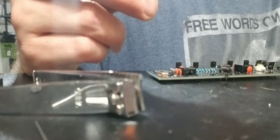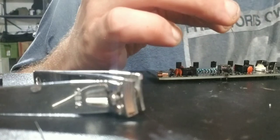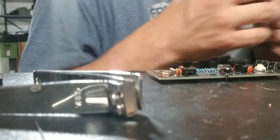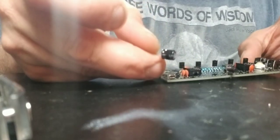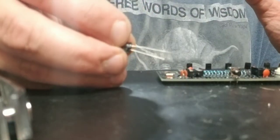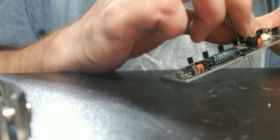C0 in the instructions here, because I've got to find out which electrolytic capacitor it's wanting me to put in, because I have two electrolytic capacitors here and I have a C0. C0 is the 10. Let's see if this is my 10. Alright, so yes, it is this one. Big fella. 470, man. The long leg on these is the positive. It also does have it marked on the shorter leg that it's negative right there. So, positive is the long leg.